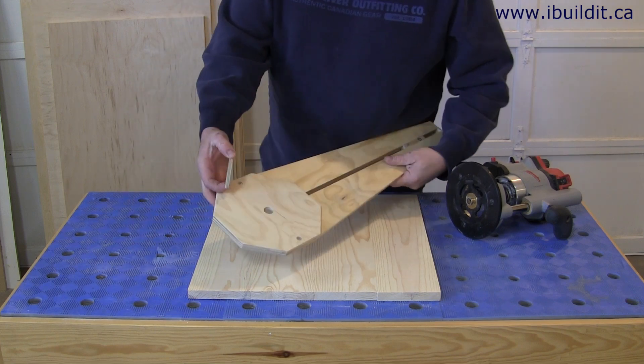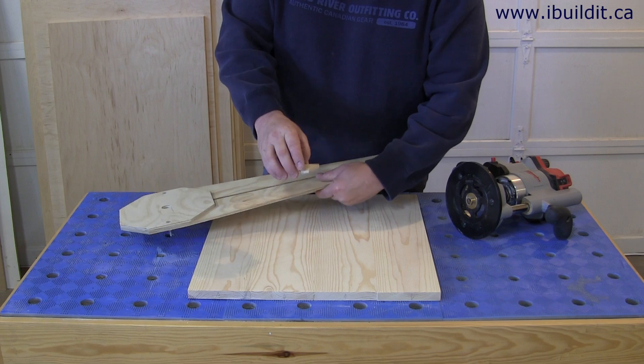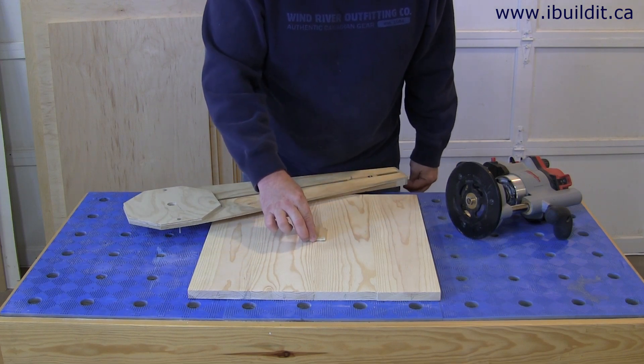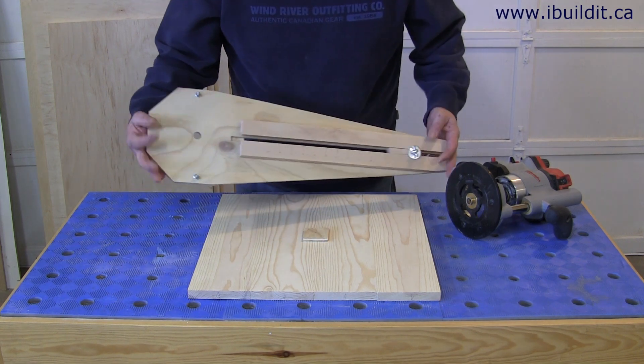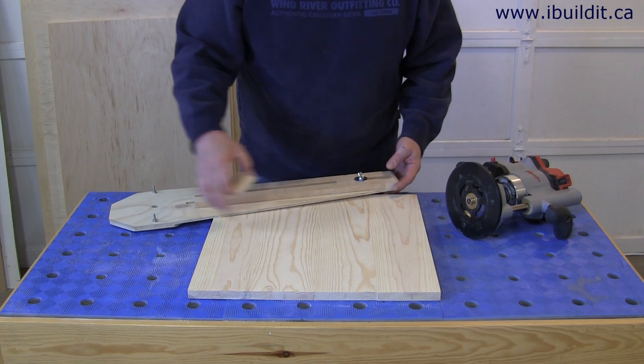What I have is a piece added to the jig that makes it a bit thicker on the bottom, and I have a pivot point that I'm going to stick on to the center of the blank with double sided tape. That will allow me to route the circle out without making a hole in the top at all.